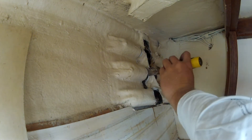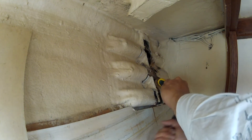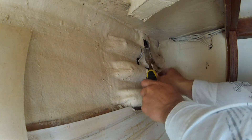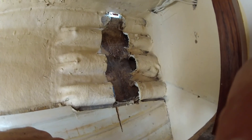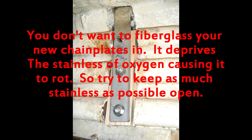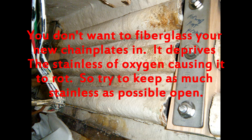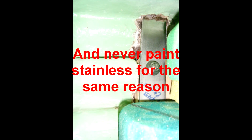I decided to go with a through-bolt system this time, bolting my chain plates all the way through the hull. I needed something for backing and had one and a half inches of standoff from the hull, so I used two three-quarter-inch oak plates, cut them to fit — about two inches wide. I had the holes already drilled in my chain plates, so I lined up the holes, placed the backing on the hull, drilled through them and all the way through the hull.